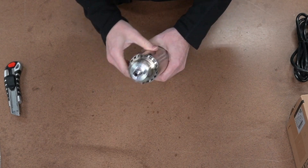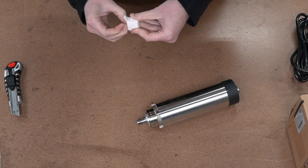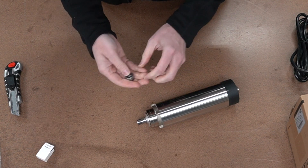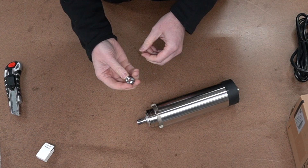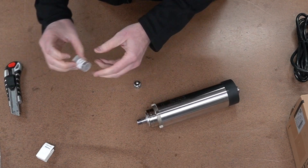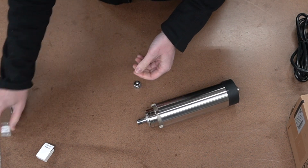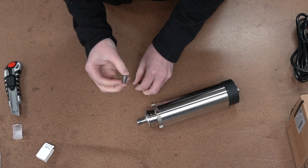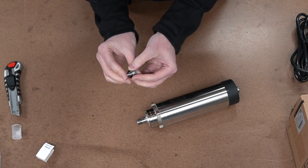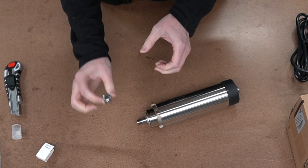On the topic of the motor, we have the silver PwnCNC collet nuts — I'm very happy with these, they look really nice. This is for an ER11, and if we grab one of our collets — this happens to be the quarter-inch version — you take the large end, stick it right in, and it should snap into place so you can hold it.